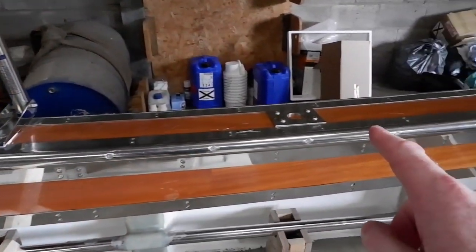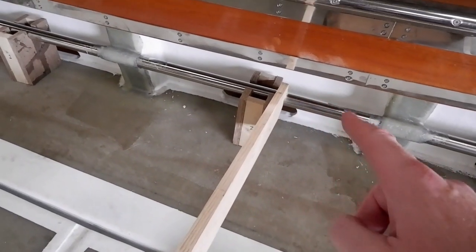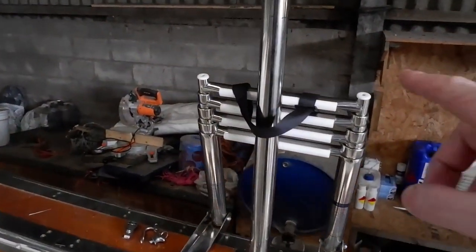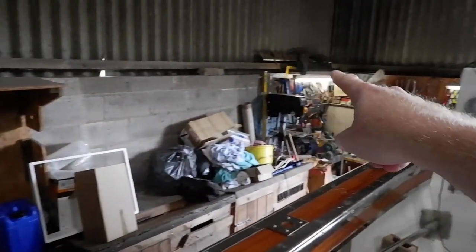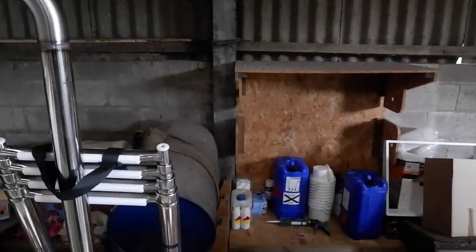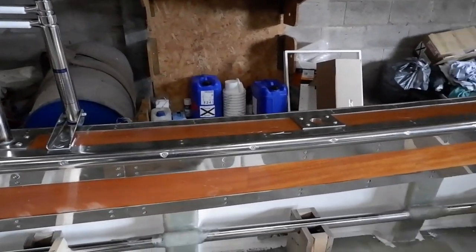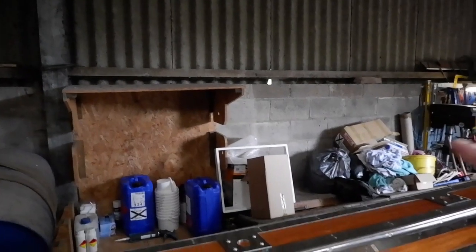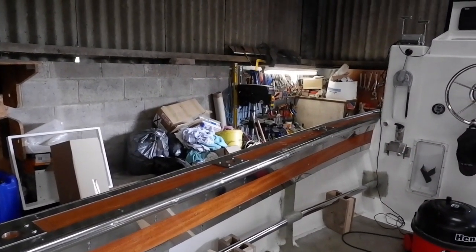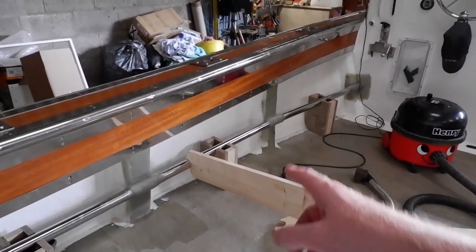Now as you can see guys, we were able to put these pads in, and because of the pads, I was actually able to put the pole in for holding my fenders, etc. Because we found out that once the pads were on, it was actually easier to weld all this on the boat. So the handrail, 1 metre from the deck, goes from there, basically right across to where the handle is on the console. See the black handle on the hydraulics? That's where it's going to go. Obviously it's a sweeping deck, so it gets a wee bit shorter at the top because the gunwale rises up. But yeah, still got that to do. There's the parts over there, and we just need this top bit rolled because when we were rolling it with the hand hydraulic pump, it was just creasing, especially the further round we were getting to the actual corner of the boat, this quarter stem there. It's a bit of a nightmare. One of these pipes is not cheap, so we can't go wasting too many of them.